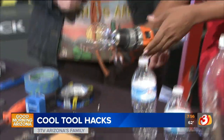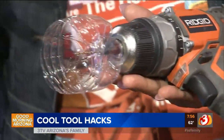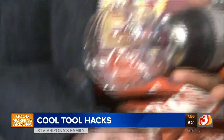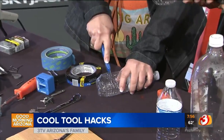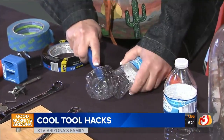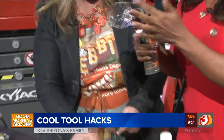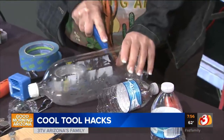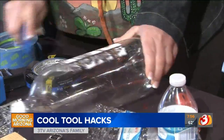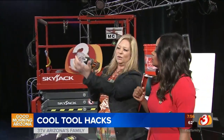Here's a fun gadget: if you're drilling a hole in the ceiling and making a mess with drywall dust, take a water bottle and your utility knife, cut the bottom off, drill a hole through the bottom, and screw it right onto the drill bit. It makes a cup to catch all the dust. If you want a bigger one, use a two-liter bottle. All the dust trickles down and falls right in, especially when drilling upward — it really helps with cleanup.